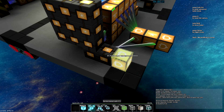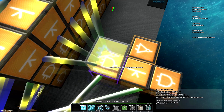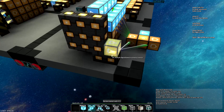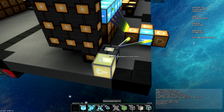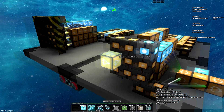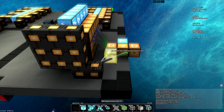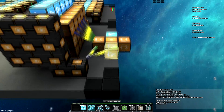Now if you want to change this from a toggle into a SET and LOCK, you'll want to take your flip-flop into a NOT, and then that NOT into the AND. Of course we'll have to get that NOT into the proper state. So now if we type in 1, 2, 3, 4, 5, you'll see that we can hit ENTER and this is locked — your door is open, or whatever. But if we hit it again, it doesn't actually toggle it until we reset the switch. That's also a benefit, because if we enter the combination and lock it, and then somebody comes up and hits the button, you'll see that it doesn't automatically unlock until we actually hit the RESET and CLEAR button. And you can add some more circuitry if you want — once it's unlocked, you have another button that actually opens and closes the door depending on if this is unlocked or not.